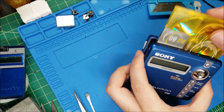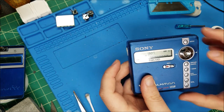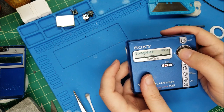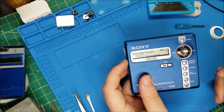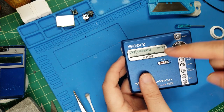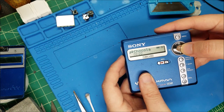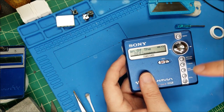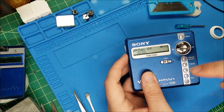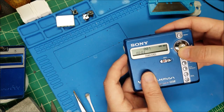I'm going to test this more thoroughly with a mix of other discs to make sure the laser itself is still good. Menu button works, it brings up the menu, I can cancel, I can play - it's playing. The way it skips, how quickly it does, tells me the laser is still good. If your laser is dying, when you go to skip towards the middle or end of the disc, it's going to take a long time and be stuck at 00:00. Also, it might play beginning tracks but not end ones - but this one has absolutely no trouble and starts playing immediately.